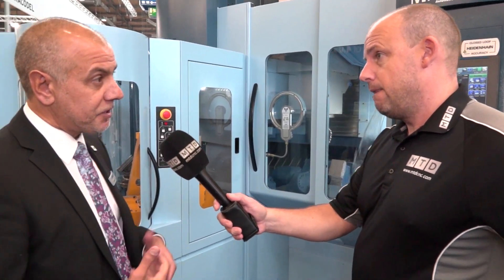Just when you say payload, what do you mean for our viewers? The maximum weight of the workpiece that we can put on the pallet that can be transported into the machine. So what we're saying is previously, maybe with a third-party supply, you might be able to get 200 kilos on the five-axis table, but you couldn't get that on a pallet, so you couldn't get the best utilisation out of the machine? Correct. What we found once we started selling these solutions was that we were restricted to a 30 or 40 maximum kilogram payload. This machine is a half-metre capacity machine, so what we were finding was that the diameter of the workpiece was relatively small for its true capacity and the maximum weight.